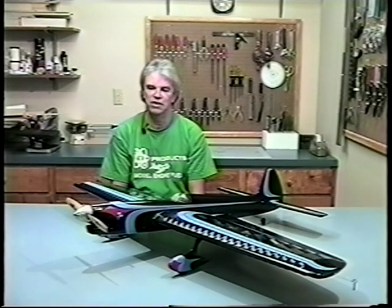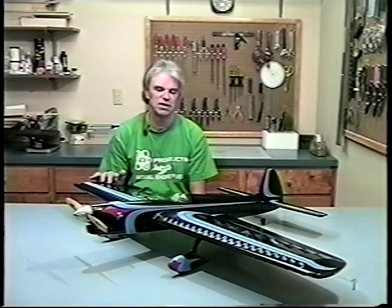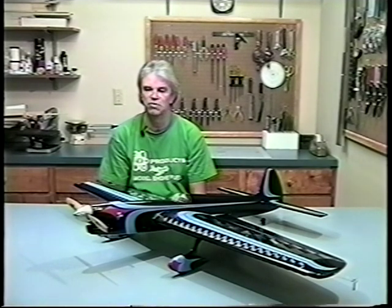So what I'd like to do is, as we move along through this, we're going to build a complete Aries wing and try to answer any of the questions, as well as showing which we'll initially start with, the way the wing is plotted and the way the airfoil is plotted and the way you come up with your beam sizes. This whole thing, while thought to be complex and appears to be complex and made worse by the Ambroid kit and things that had a lot of voodoo in them, this should pan out to be an easier project for most people than they would think.